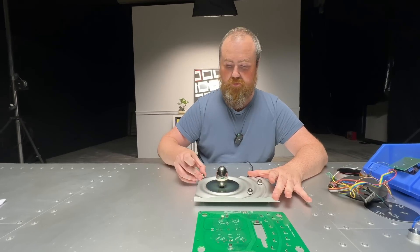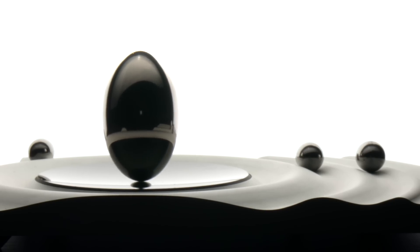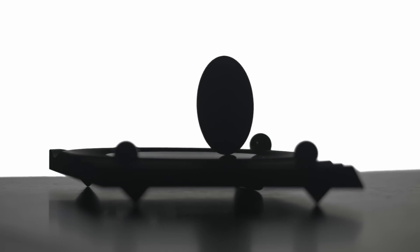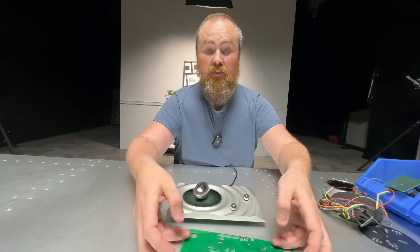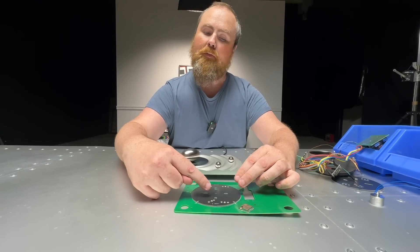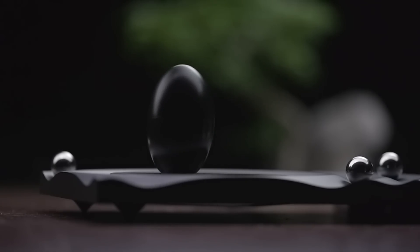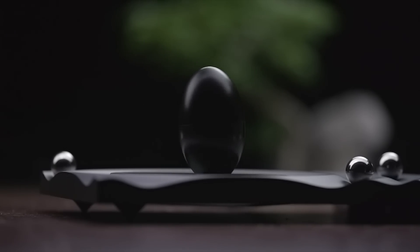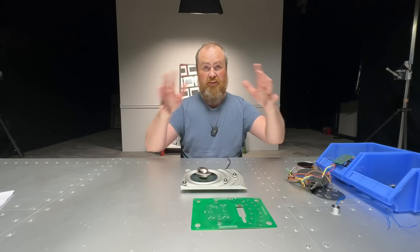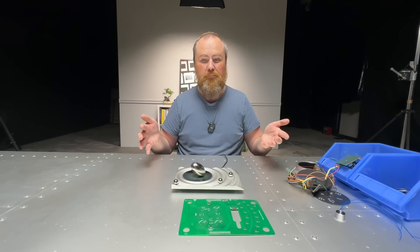We also added two modes. You can change the mode by moving this ball. The first mode just changes the speed and the egg stays in the center - you can poke it and it moves around. Then we have the random mode: since we have four coils and sensors everywhere, we can pull the egg to one side or push it away in a manner where it starts to oscillate and move around very randomly. The analog sensors take in all fluctuations from the environment and add that to a randomness algorithm.